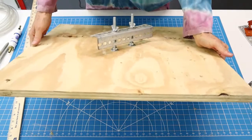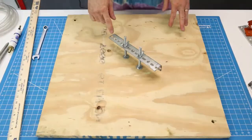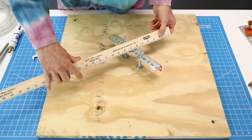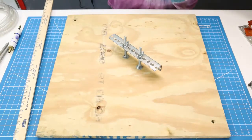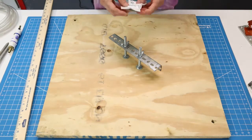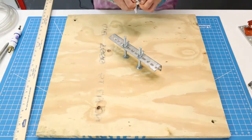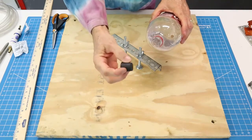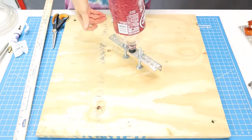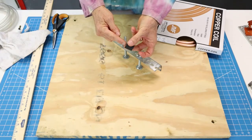From the side you can see you can adjust the height of each side independently. The round holes are 3/8 but I had to drill one out to a half inch — this is where the cork is going to sit and be pumped up with air to launch the rocket. I bought a Hillman number 4 rubber stopper from Lowe's, about a dollar 39 cents. It's smaller on one end and larger on the other, and it will fit inside a soda pop bottle. The whole assembly is going to sit on the launch pad like this.